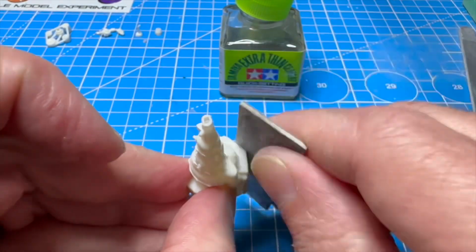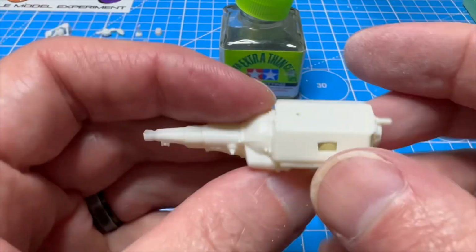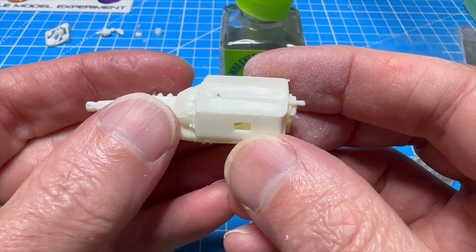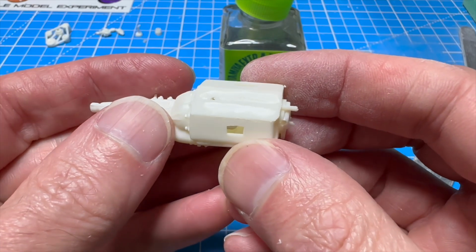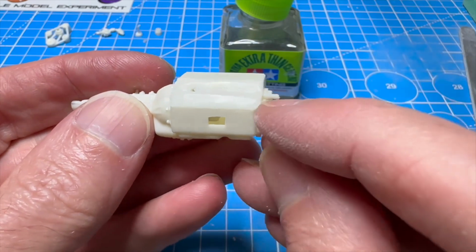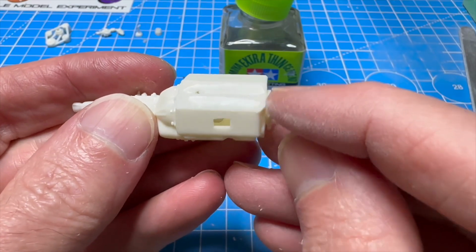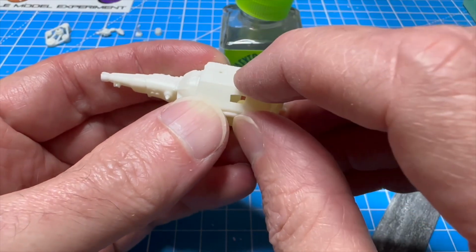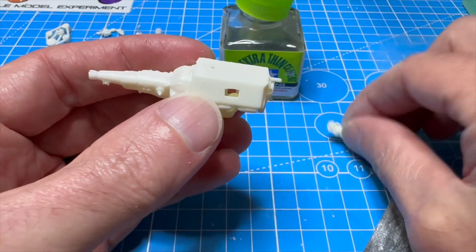And let's check the plastic. Can you see the shiny part is in the middle? That means that's a low. And then the dull spots are the highs. That's what the sandpaper actually hit. So the center section is low.